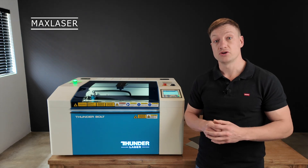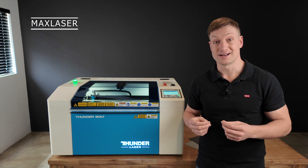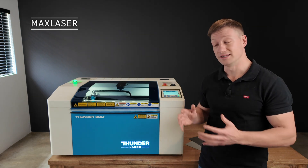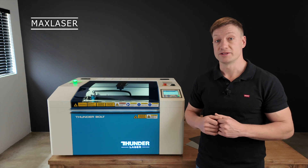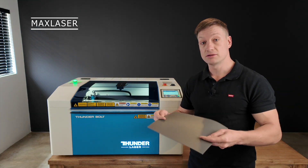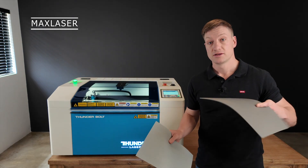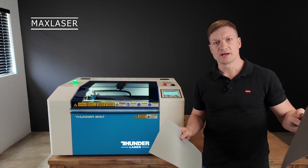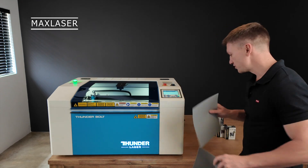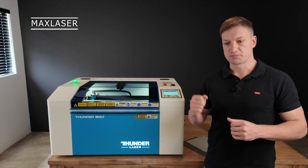Glass laser tubes can do it, but not to the same quality. Where you really see the difference is when you go for a smaller font size — below 8pt, 7, 6, and so forth — that's where metal laser tubes really shine. At Max Laser we sell two types of laser material: laser rubber and laser plates. The laser plate is polymer — easier to engrave through — but some say the laser rubber has a stronger shoulder when clients really smash those stamps.